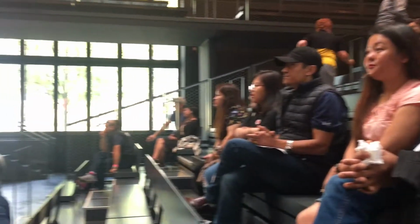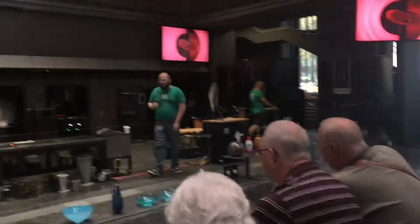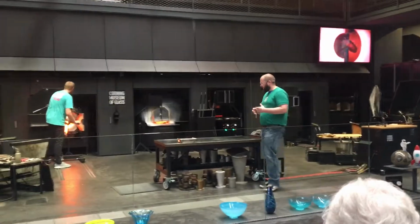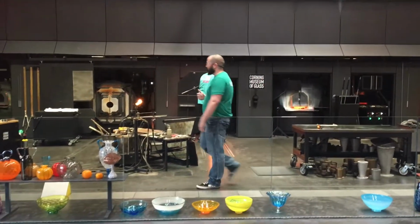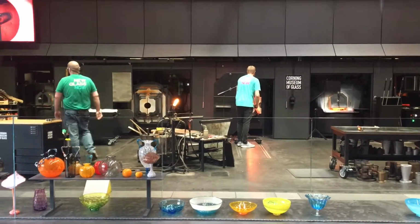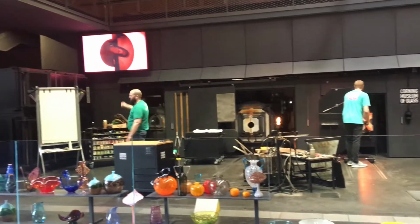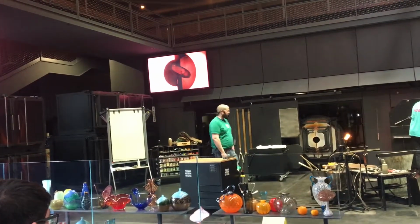In order to get that jack line to break away, that had to really cool down, had to be some firm, rigid glass. The glass is still kind of warm, moving. It's not going to want to have a crack run through it. That's also the area he now wants to shape. So he needs it like molten, needs it moving around. So we'll take a little extra heat in there. Again, you can watch inside that reheating chamber. There's a camera in the back of that.